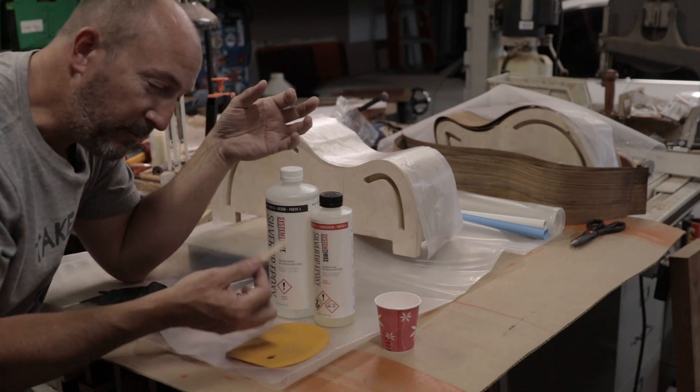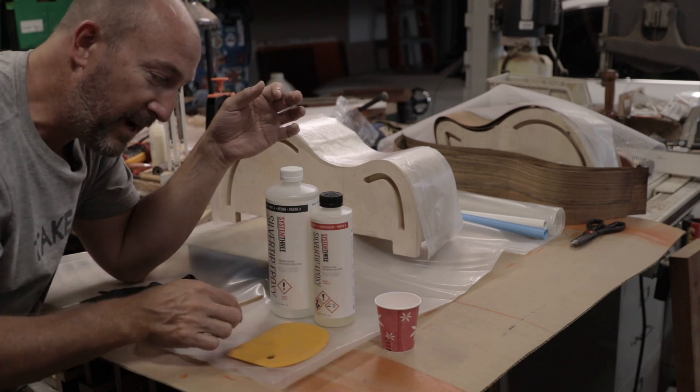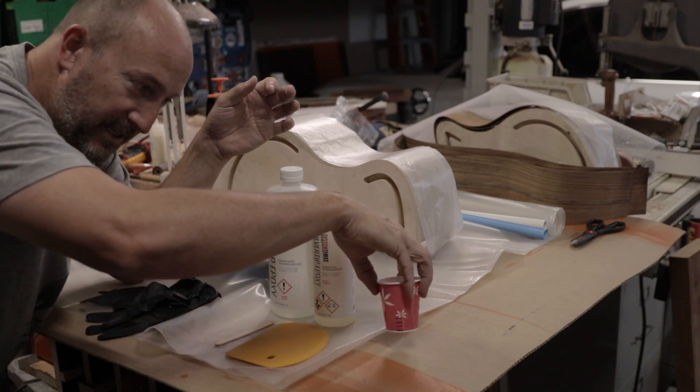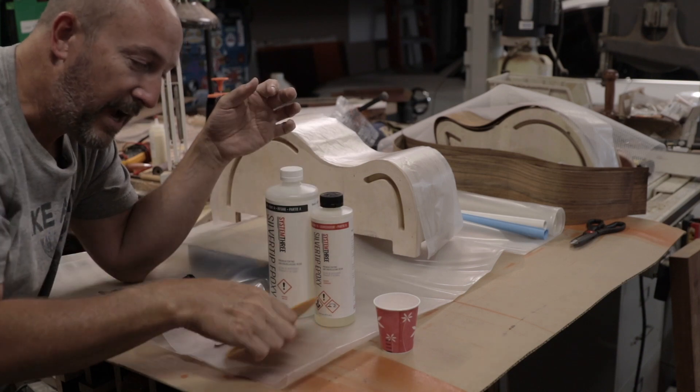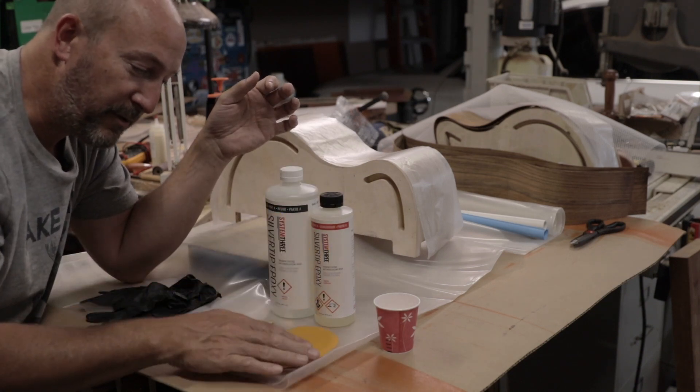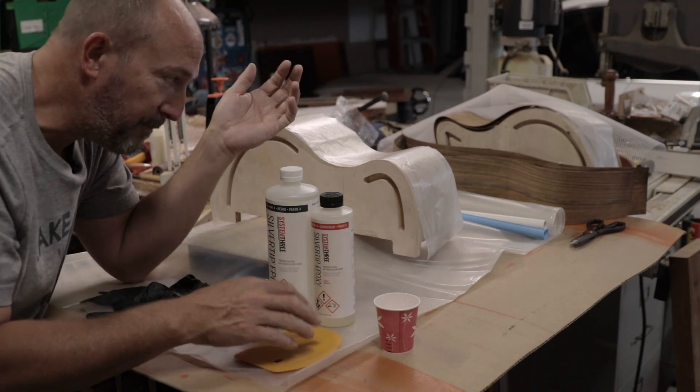So we all know the components I'm working with. I've got a popsicle stick - I buy these in bags of like a hundred to mix the epoxy together. I've got a little Dixie cup that I put some graduations on. This is a two to one mix. I've got a silicone spreader - you can use a Bondo spreader or whatever, but these work a little bit better for this operation.